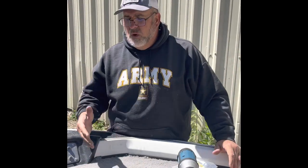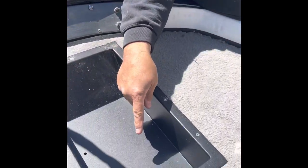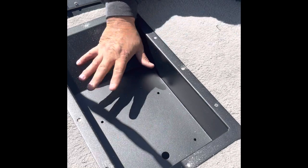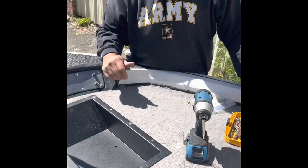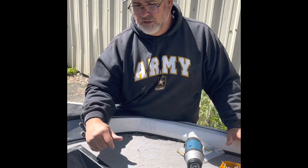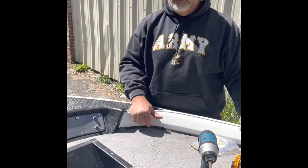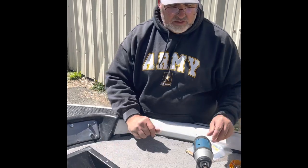Some of you are wondering what the holes are inside of here. There are water holes — down inside here is access to the bilge. As soon as water drips down through here, because you don't want this pedal to fill up with water, it gets down here, goes into the bilge, goes all the way to the back so it can be sent out of the boat when you're pulling it off the water or through a pump. So all that's going to go through here is water. The pedal, when it goes in, is going to cover all of these holes so you're never going to see any of this, and we're just going to go ahead and fasten it down to the actual bottom.